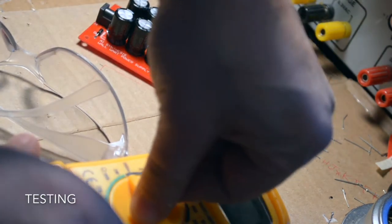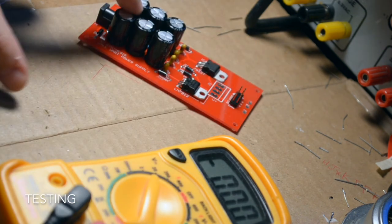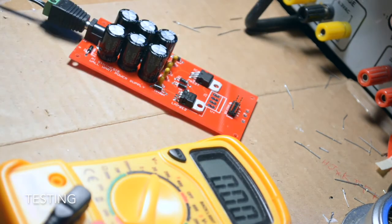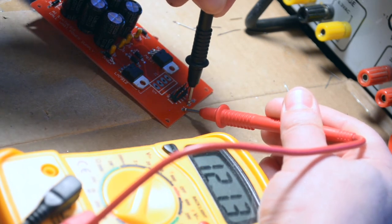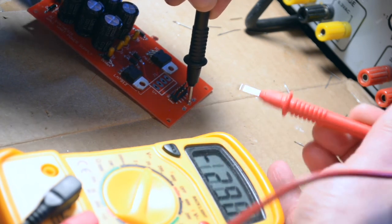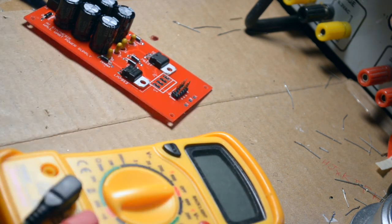So when you're ready to test, grab your safety goggles, your multimeter, and your AC output wall wart. Very important that it's AC output, not DC output. It can be anywhere from 12 to 16 volts for this circuit without causing any problems — you don't really want to go too much over that. I've got my safety goggles on, I plug it in and just wait — I make sure that it doesn't explode. If it is going to explode, it will do so fairly quickly. I'm using the wire pads for testing. I've got 12.13 volts — that's great. And negative 11.8 volts — that's just fine, modules won't worry about that at all. Now I'm just going to let it burn in and chill out for about 20 minutes to half an hour, and then it'll be ready to use. Thanks for watching.